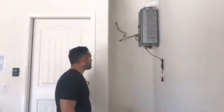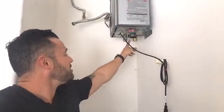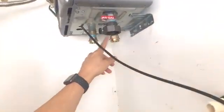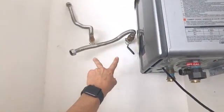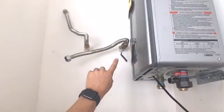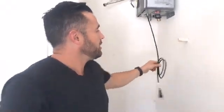We sized our gas line and ran a new gas line coming in along the garage to feed the unit. You can see here where we hook the gas line up, this is where we hook our cold supply in, and this is where we hook our hot feed in. The old water heater supply and return lines are coming up from the top — they're going to cut that out and feed it into the new tankless unit.